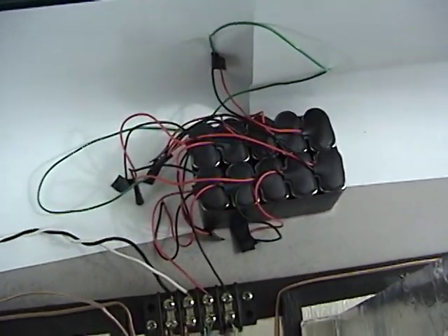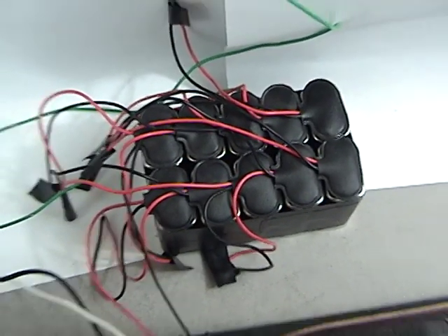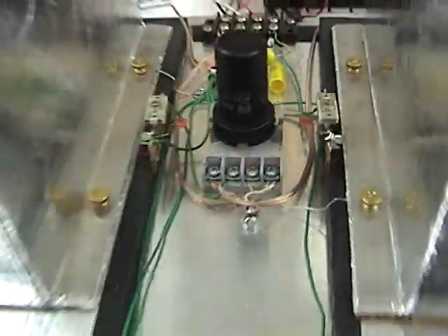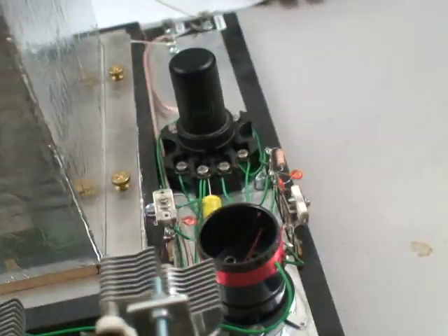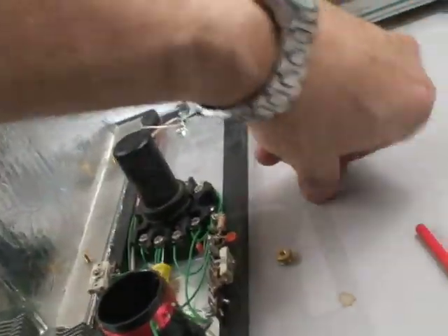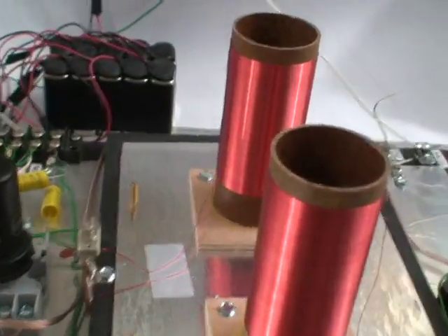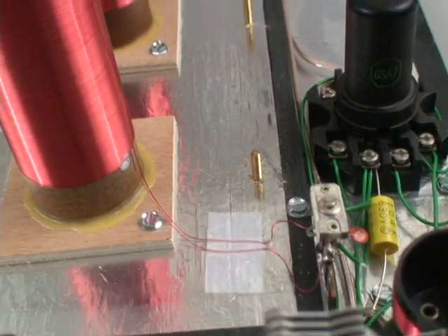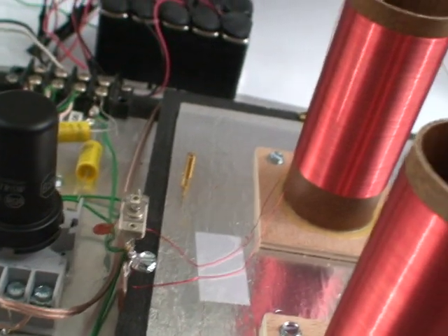Here's my 90 volts — actually, I think we're down to about 70 volts right now. And I just have a filament transformer lighting the filaments. I'll show you how this comes apart. And there are the coils. Of course, each coil has its own trim cap here, and they're both peaked. I think my IF frequency is about 455 kilohertz.